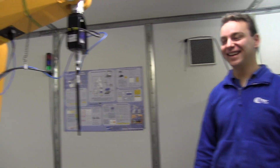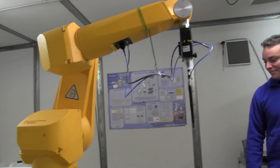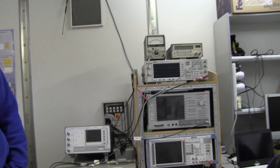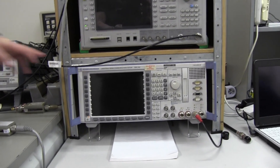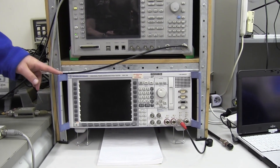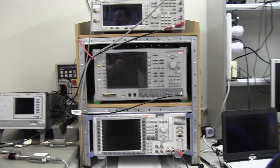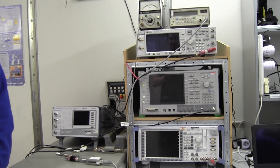Fantastic — I love it. How much does something like that cost? About a million dollars — that's just the robot. Then we've got the phone simulator as well. So this is the test setup that simulates the mobile phone — it exercises the mobile phone. Right, because we're in a shielded Faraday cage, so we can't get a real signal inside, so it calls up a sim and you put the sim inside the phone. That way we've got full control over the power output, frequency, and everything — so it's a controlled environment.